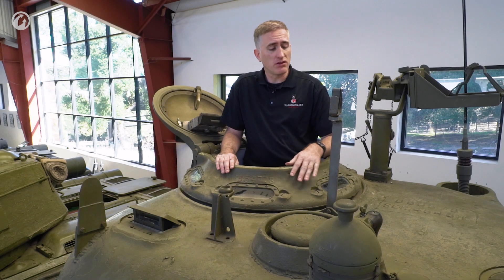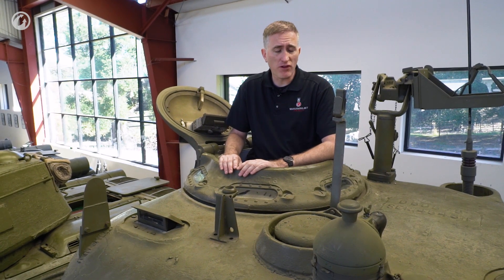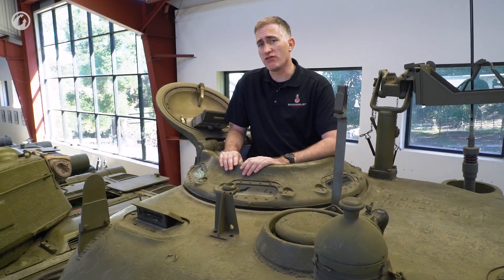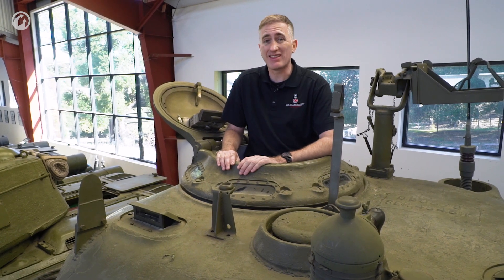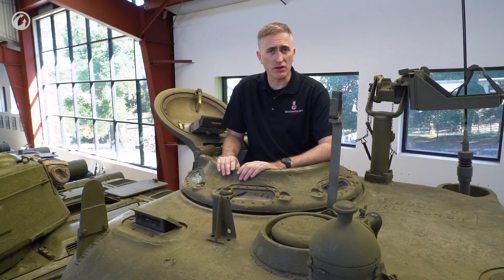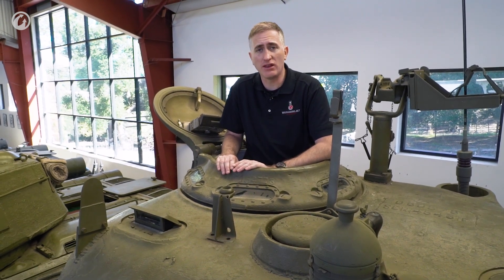The first thing you'll notice looking at the turret is that there is no loader's hatch, which is a surprising omission. In fairness, they were still learning — the M3 medium didn't have a loader's hatch either, but it was a smaller turret. If you've got to get out of the tank in a hurry because, say, the tank is on fire, it's a bit difficult if you don't have a hatch of your own. What is perhaps less excusable was that it took a year and a half of production and about a year's worth of combat experience before somebody finally figured out how to drill a hole in the roof of the turret and install a hatch.